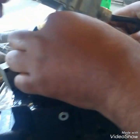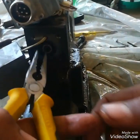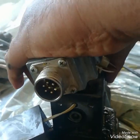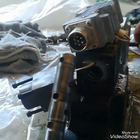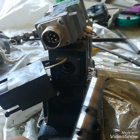Now I am removing the other coil so we can clean both sides. After cleaning, the maintenance of this DC proportional valve will be completed. I will check the condition of the plunger inside. I am removing the plunger — we just need to push it from one side or pull it. It's a little stuck, so I will push it from the other side. Now it is free. Here you can see it is just like an SOV — it has a plunger.